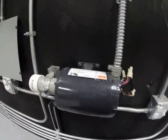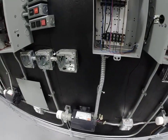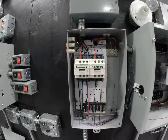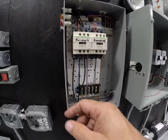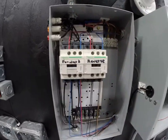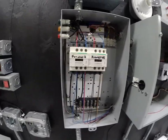Also, if you remember, we learned that if it's a three-phase motor, we could adjust the rotation of the motor just by swapping any two leads anywhere in the circuit. We could move this one over to here, we could move that one over to here. We don't need to do that because we actually have the contactor with the bridge jumpers that go across the forward contactor and the reverse contactor.